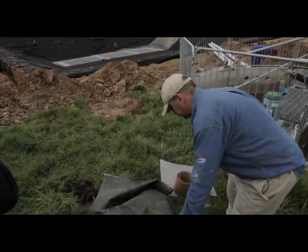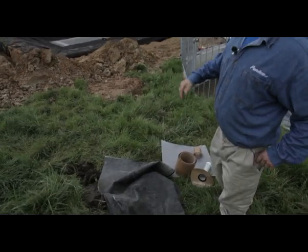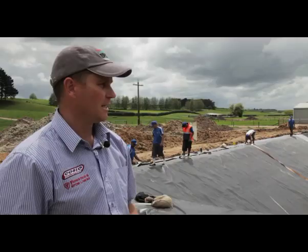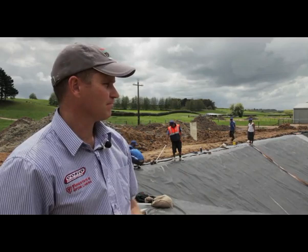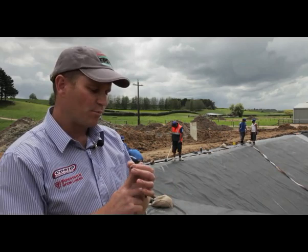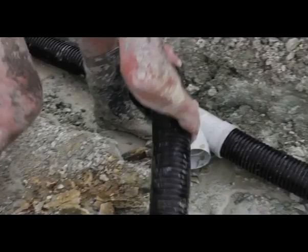When it's underneath the liner like that, you can see it's really hard to penetrate it — it is really good protection. Depending on the area or the type of soil the pond's been laid in, we can use different grades of geotextile. It does add to the cost, but it is the correct way to design and build a pond. Failure to use a geotextile underliner can leave sharp stones underneath, which can create pressure points or isolated protrusions beneath the liner, causing complications later down the line.